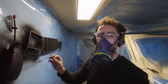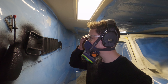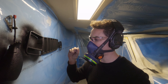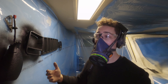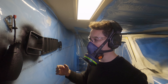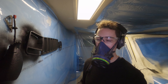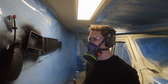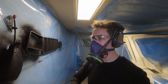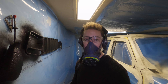Some of the blobs are looking really big and that might freak some people out, but trust me, they reduce down and go real small. When this stuff cures — after about 21 days, or enough after five days — you'll notice those areas that look really built up and blobby actually shrink down tons. So don't stress out too much. When we come back for the second coat, just hold the gun further away and just dust it off — you'll get a bit of a finer texture. We'll crank up the psi. This looks good to me so I'm going to keep going.